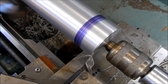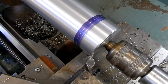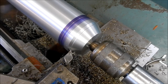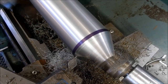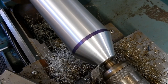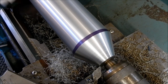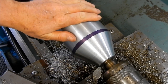We've got to come 50 millimetres from the face down - that's the end of our taper. I've marked that off with a bit of blue and put a scratch on there, so that's where we're going to come back to. We'll make each one the same as we go through. That's the first taper cut done.